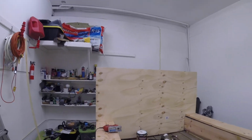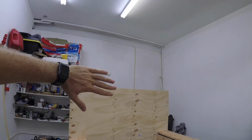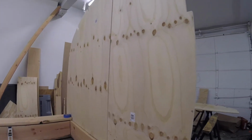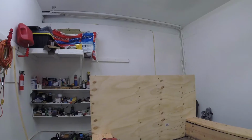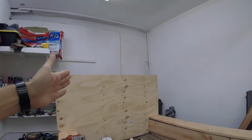And similarly in the back, the only way that you're going to get the top section up there is if you start to do the framing, right? So this is kind of a bit of a reverse build in that the front and back are sheathed already, if you can call it that. It's pretty thick sheathing. The only way that the top section is going to go up there is if I start to frame out the door, and that's typically how I do this.